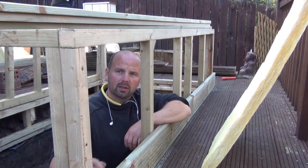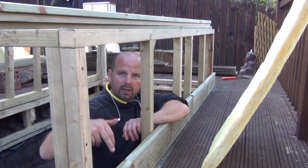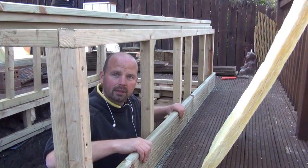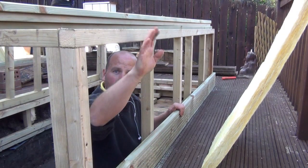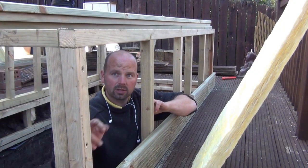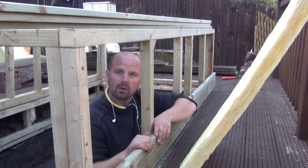The latest task was to build four frames out of dressed 2x2 which is pressure treated. They go all the way around the pond, all screwed together and screwed down to the existing deck. They're screwed together at the corner so you've got a double thickness corner. On the outside they're going to be clad with 6 inch by inch and a half pressure treated decking all the way up. On the inside, insulation is going to be packed in — we've allowed about 18 inches between the two frames — so all we need to do is cut it to size, slot it in and then fix it with the hardboard on the inside.